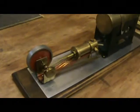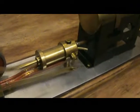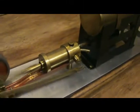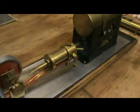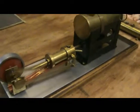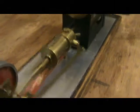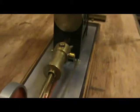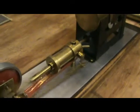Now the reason I suspect is that the pretty great block of brass and cylinder, which looks very nice, must take all the heat away from the steam and condense most of it into water. As you can see, the hole for the piston is much, much smaller than the outside diameter of the cylinder. That cylinder is almost solid brass.